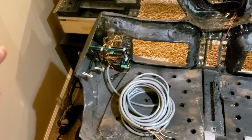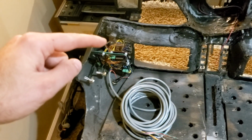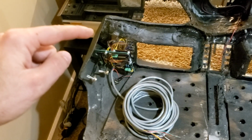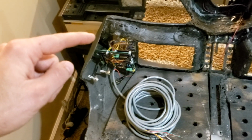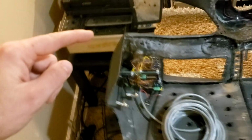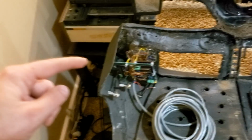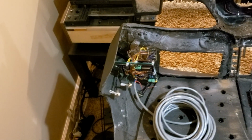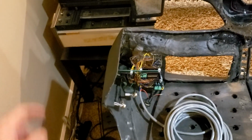The theory behind this is we've got the new compass board up here, and I'll show it to you in a minute. It was milled out of 1/8 inch aluminum, because if you remember, we don't have the original compass board, so we recreated it. We put the exact same textured overlay on the aluminum bezel, and then we had custom silk screens made to match the font. So it's going to be about as close as we can get without having an original.